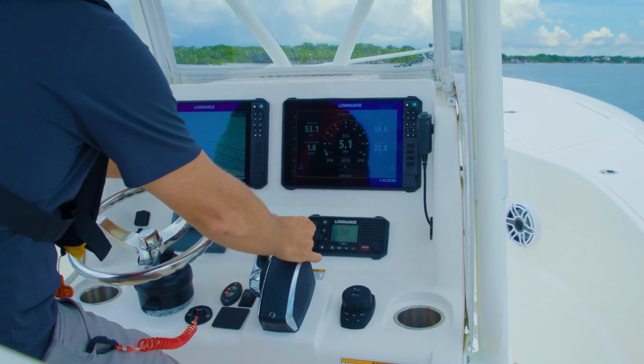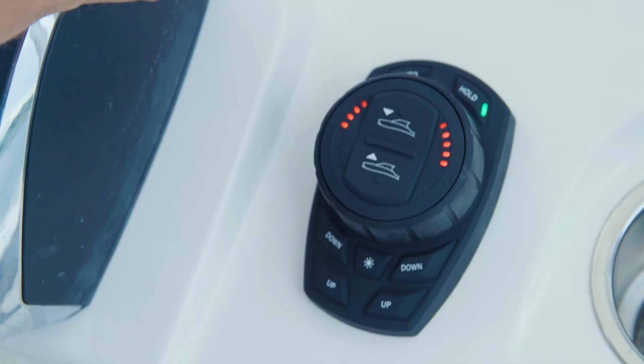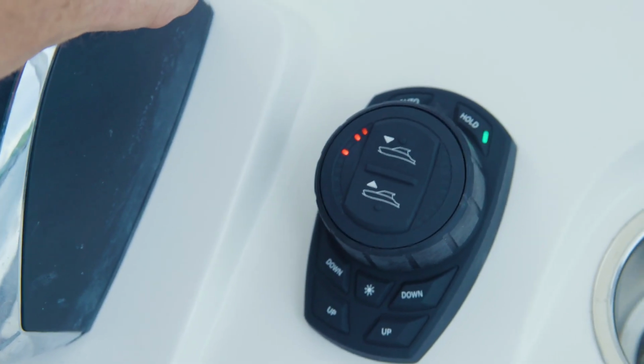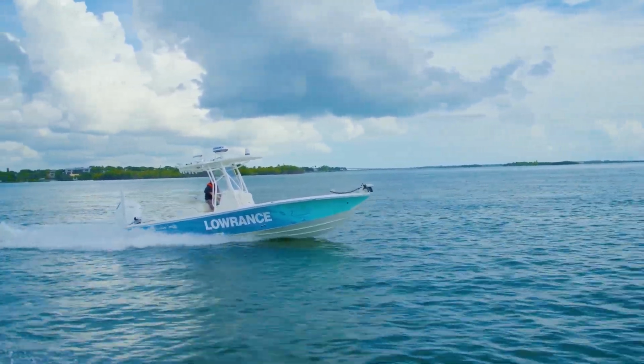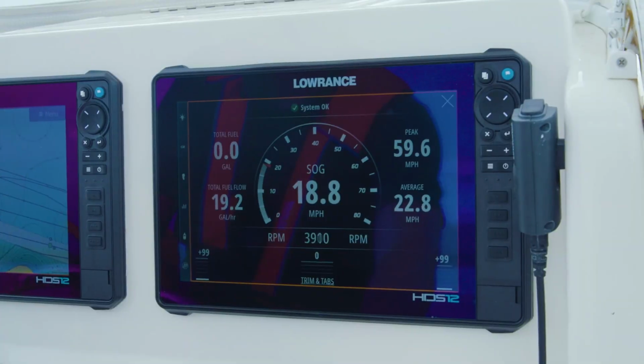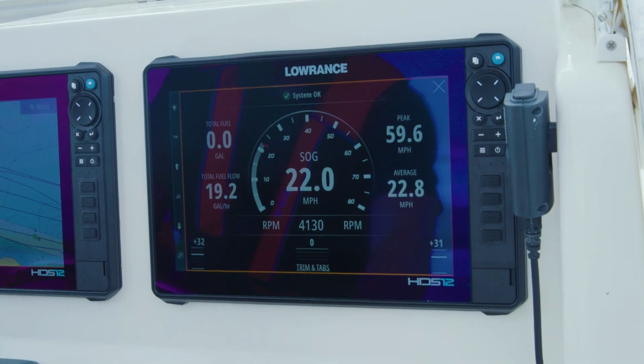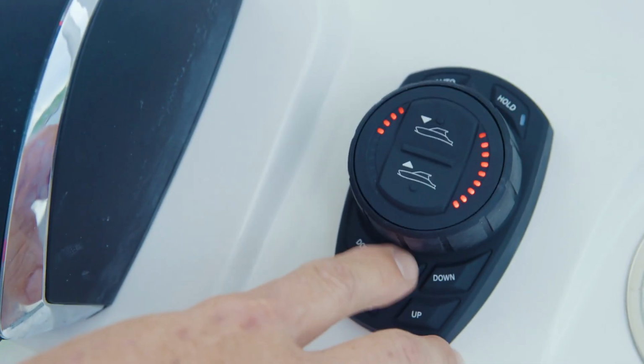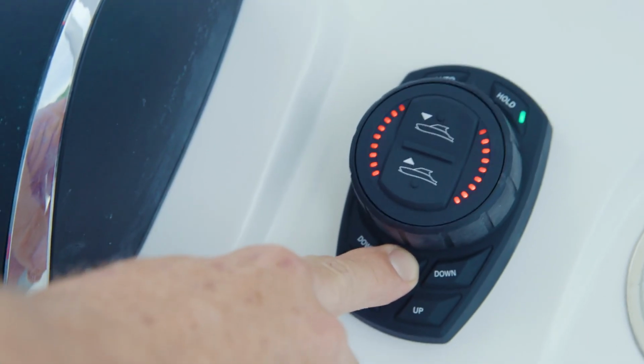Slowly ramp up vessel speed by applying throttle. Watch the keypad during this process. The indicator lights will flash once the system detects peak bow rise followed by slight bow fall. It is important to ramp up speed slowly and capture this process at the moment in which it occurs, as indicated by flashing LEDs, by long pressing the dim button.